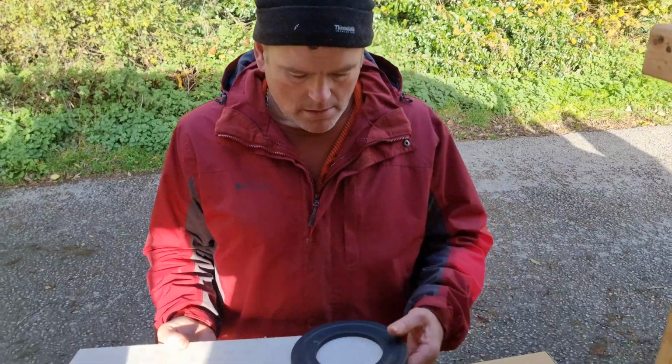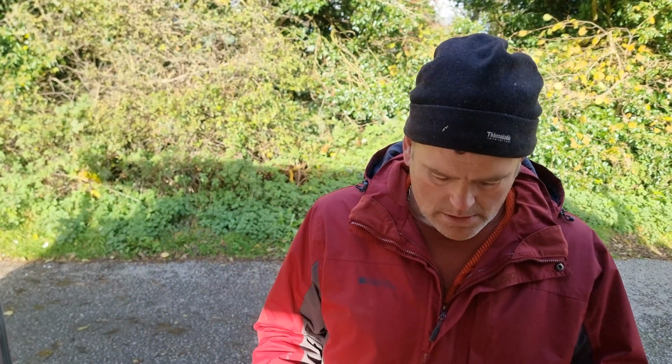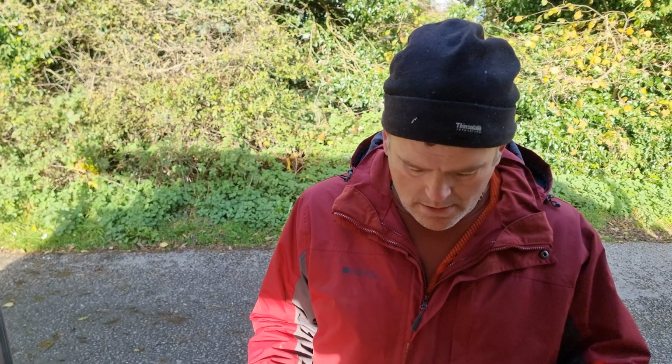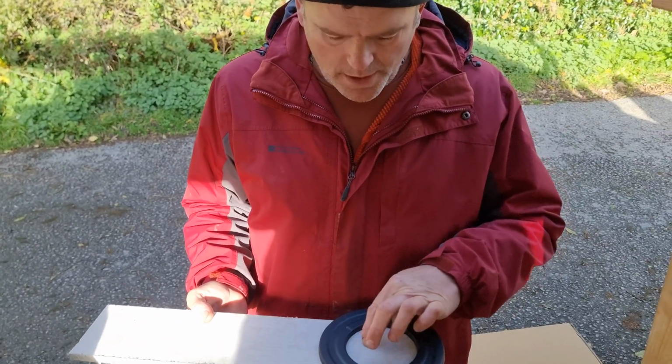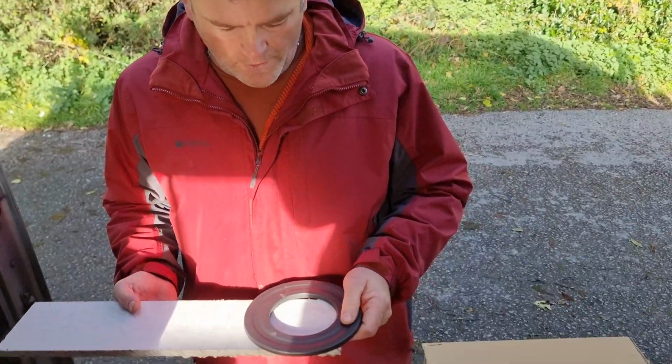A collar in it. It's an interior collar, yeah. But it's 100mm, not 60mm. You can't get it in 60mm, it's hard. So we're going to put a bit of this cement board inside, and then 60mm in that. So you've got something to hold the chimney inside and outside, stop it moving and vibrating about.